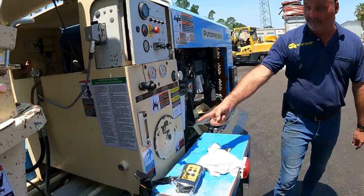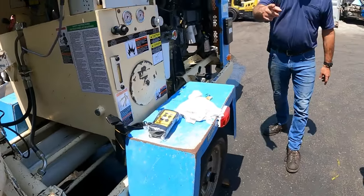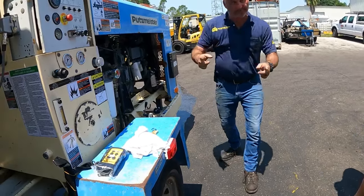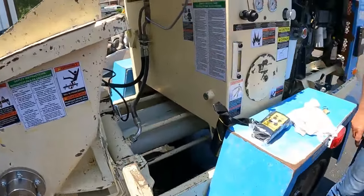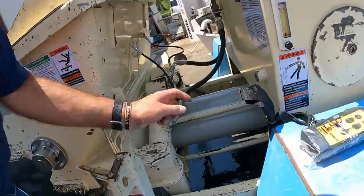So moving on, you've got your material cylinders, which house the concrete. As one's pulling, one's pushing. Brand new. Right. As the rock valve's orientated in this hole, it's pushing concrete out through the hose, one is sucking back. Then it switches over, and now that one's pushing. So that's how that works. Your switchover cylinders, the switchover head, the retaining plate.